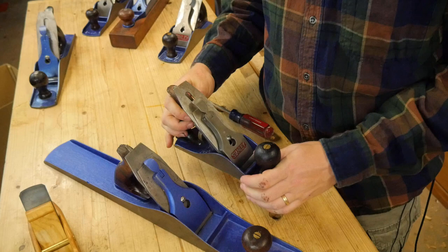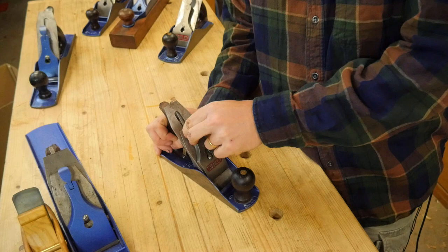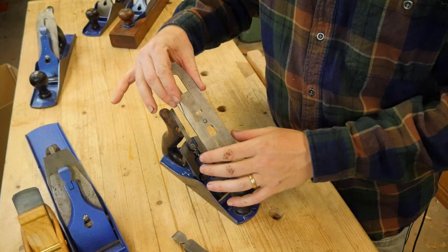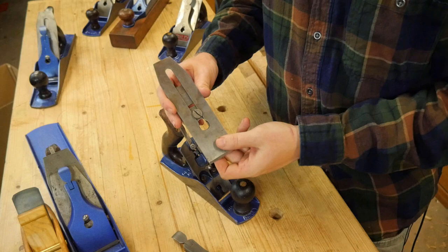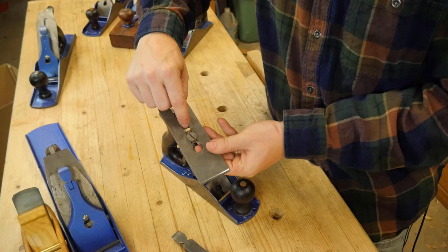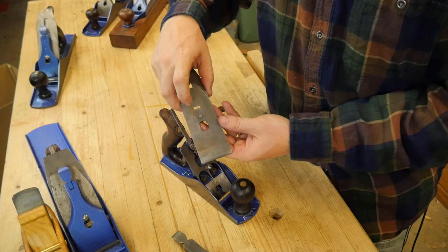Let's tear this apart and show you how it's actually made. First, remove the lever cap — pull it up and slide it up. The lever cap is what holds everything together and keeps it in tension. You should never have to loosen the nut to take it off; it should just pop tight. Underneath we have the iron and the chip breaker. The iron is basically designed so you can sharpen it right up to where the eye is, which allows it to slide along and allows the adjuster to make contact with the chip breaker and grab that notch to slide it in and out.